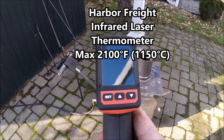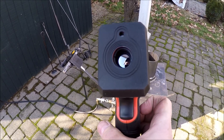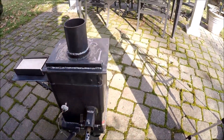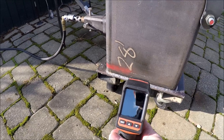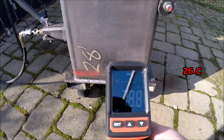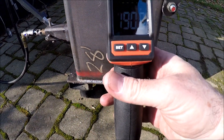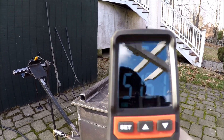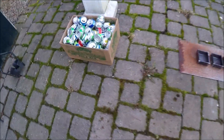The other thing I picked up was a Harbor Freight infrared laser thermometer — a new item from Harbor Freight, and it works great. It's reasonably priced, about 50 bucks. The inside temperature right now is showing about 1,550 degrees Fahrenheit. Measuring the outside, at the bottom where there's quite a bit of insulation, it's only 79 degrees Fahrenheit — so that's good. Midway up is about 194 degrees Fahrenheit, and without any insulation the loading tube is running at about 515 degrees. So the insulation is working.